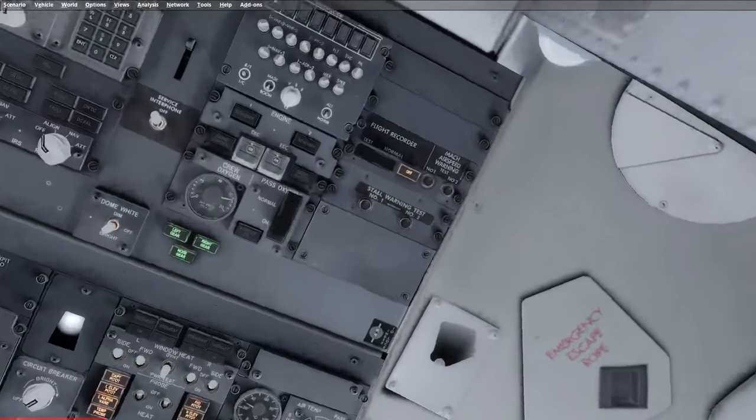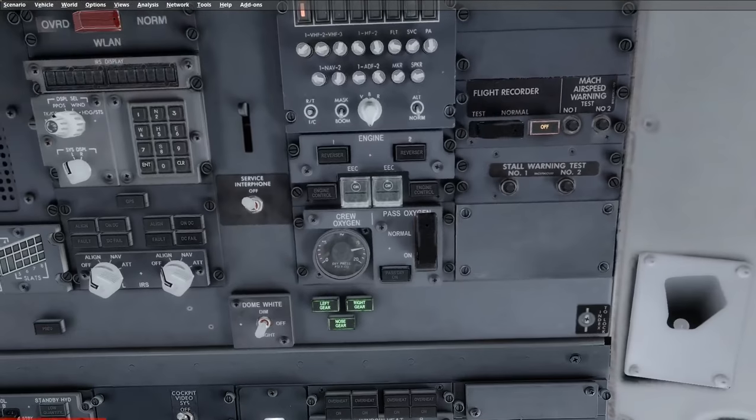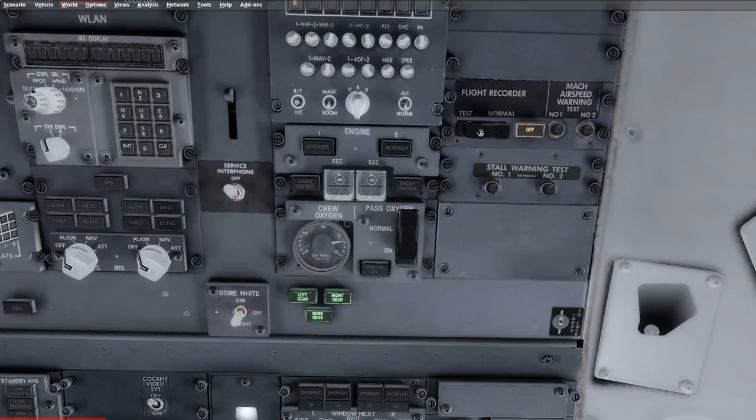After that we can check our flight recorder. You lift the guarded switch and move to the test position — the off-flight light should extinguish, meaning the flight data recorder is operating correctly. Now do not confuse this switch with the passenger oxygen switch. It has happened in real airlines that pilots confuse the two switches and as they try to do the flight recorder test they deploy the passenger oxygen masks. Moving the oxygen switch from normal to on will deploy every single oxygen mask in the cabin.